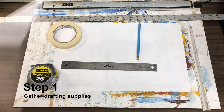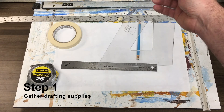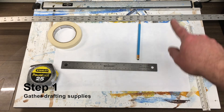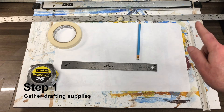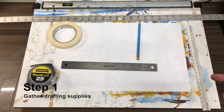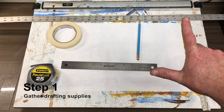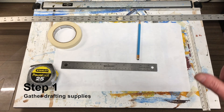Alternatively, you can also get things like triangles. This is a clear acrylic triangle that'll help keep things nice and square. Or if you have a framing square or a small framing square, that'll also help keep everything crisp and square. You can also do it using what's called a 3-4-5 triangle — you measure three inches in one direction, four inches in another direction, and there needs to be a five-inch diagonal hypotenuse between those two marks. That'll give you a nice square corner for your room.